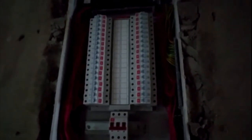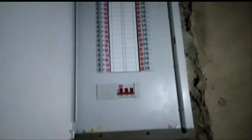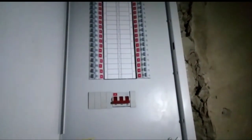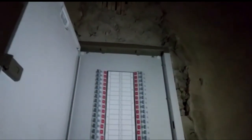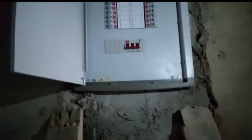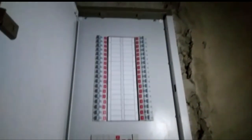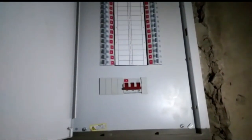The isolator switch does not operate mechanically on its own when there is over-voltage or over-current. This distribution board is called Havels — I bought it at 1,000 Ghana cedis. Others like MEM cost about 2,000 Ghana cedis, but they all do the same job. This is a 12-way distribution board. My in-law Mr. Isaac Inkansah is going to provide a load schedule, indicating exactly where all the cables are coming from — kitchen, bedroom 1, master bedroom, bedroom 2, bedroom 3, guest room, hall, sockets. The masons will come and do the dressing along the edges so it looks completely beautiful and the DB will be flush with the plastering — not protruding outside.